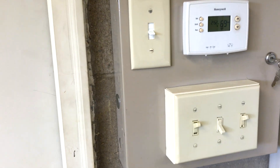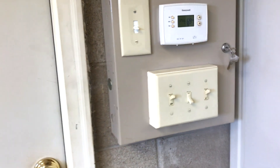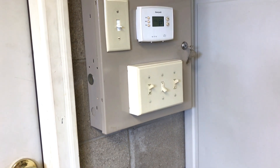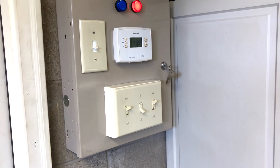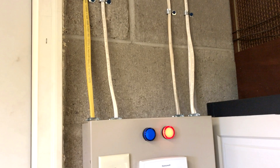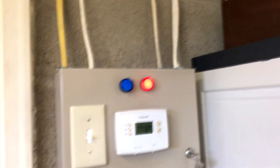The whole purpose for this fan is not so much for cooling but for ventilation — like a bath fan — for fumes, solder fumes, anything like that. We want to run it during the winter. This puts a really good negative pressure on the garage and everything gets sucked out through the fan. I'm not quite done with everything yet — I just did the wiring and it looks really good, but I'm going to put in conduit going up to the ceiling at some later point.